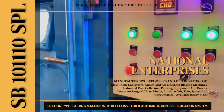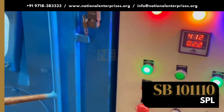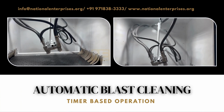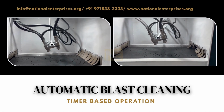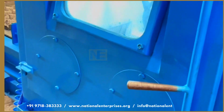SB101110 SPL Suction Type Blasting Machine with Belt Conveyor and Automatic Gun Reciprocation System. National Enterprises custom-made SB101110 SPL works on the suction induction principle of blast cleaning. A timer is provided for automatic blast cleaning or surface preparation of components loaded into the machine.